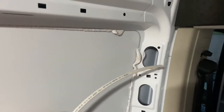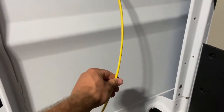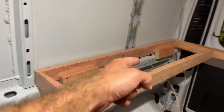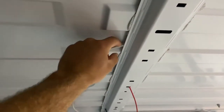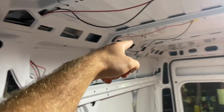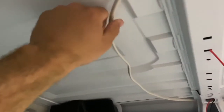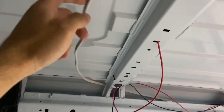This is another outlet we're going to have on our counter. This is a 14 gauge wire, and then this yellow wire is a 12 gauge. This 14 gauge wire here also gets fed back behind our bed frame — you can see it going down there. This is for our light switches. This is also a 14 gauge wire and it's going to be for our fan, so that gets wired all the way back down. With duplex wire you don't need to get separate red and black — you can just get this and that's all you really need.